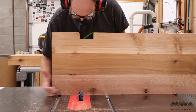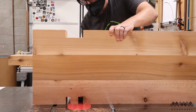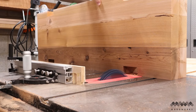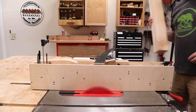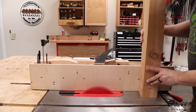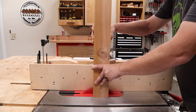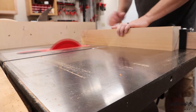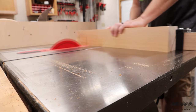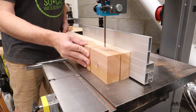Man, that is such a satisfying process — being able to clear away that much material so quickly. I was a little worried this workpiece would be too big to do this operation, but it actually went pretty smooth. Now that I have the notches in the bench, I need to create the mating notches in the legs. The goal is for the legs to recess into the sides of the bench and sit flush with the sides. To make this cut, I use the table saw to establish the top and bottom of the notch in two passes. I could finish this cut off with a handsaw as well, but the bandsaw does a nice job too.